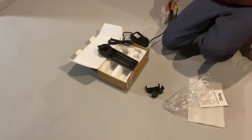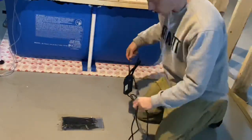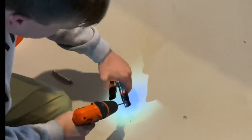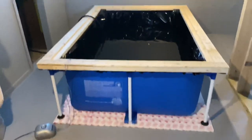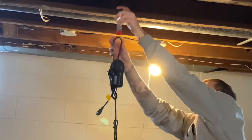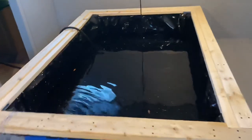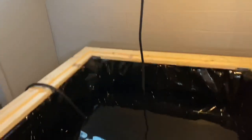When it comes to using heaters in indoor ponds, the most important thing you have to be careful of is letting the heater burn up your pond liner. I wanted to think of a way to keep the heating element off the bottom of the pond liner and suspend it in the middle of the water column. I used clamps to suspend the heating element in the middle of the water column and hang it from the floor joist. I set a screw in the clamp so I could hang the wire and suspend the heating element — this worked out quite well. This general idea is what I'm going to be using from now on because it worked absolutely amazingly.